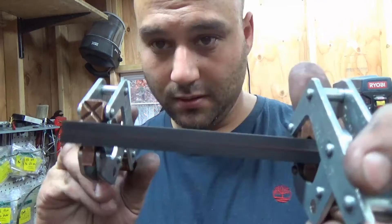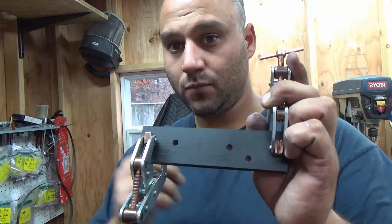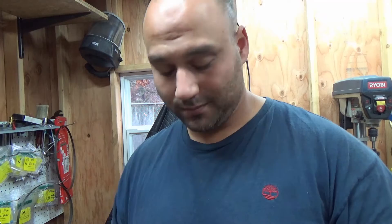We're all lined up. The liners are inside, the black is on the outside, and it's all clamped together. Now here's our template. You just want to make sure that you hold it nice and tight. Because if it helicopters, these holes are going to get ruined — it's G10, it's going to get ruined really quick. So be careful drilling. Use a sharp drill bit and take your time. Setup is more important than drilling the hole. If you're doing it and you're questioning yourself, stop what you're doing and reset up. I've made so many mistakes doing stuff like that — take a lesson from me, I learned the hard way.